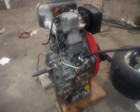On these Yanmar and Yanmar clone single cylinder engines, the fuel screw is actually really simple and easy to find — it's right here. All it does is limit the throttle linkage. This is the shaft that goes into the engine and connects to the linkage to the injection pump right here. It travels down here. So it'll be cruising at the governor or wherever you have the throttle set, and when the engine comes under load, it'll try to compensate by adding more fuel, by pumping out more fuel. So the pump will go this way until it hits the screw here, in which case it can't fuel any harder.